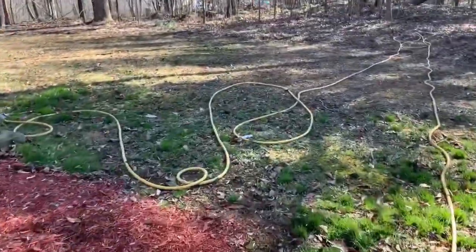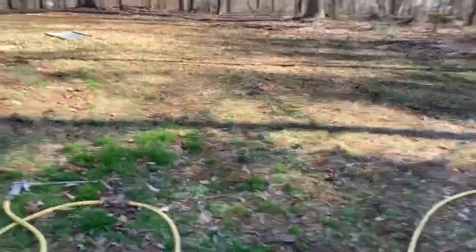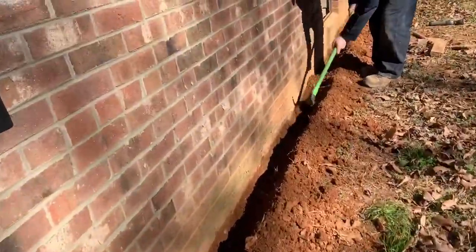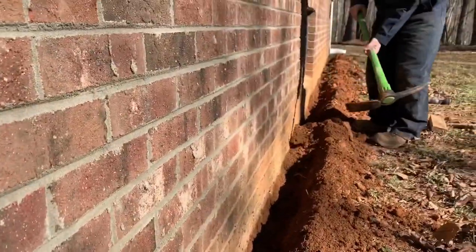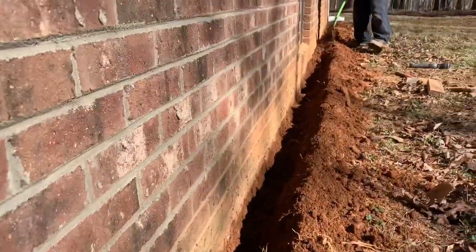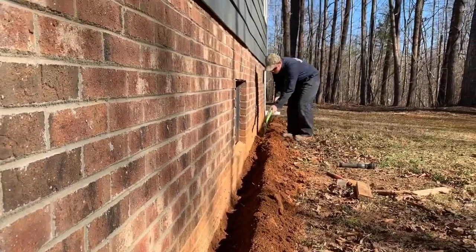When we're doing the outside, one thing we need to do is trench the outside foundation walls. It's not too bad of a situation — we want to put a nice trench along that foundation wall, get down to about the footer. You can tell we're near the footer now. We're going to put the chemical down beside it. We're going to clear this all out and trench the outside foundation wall.